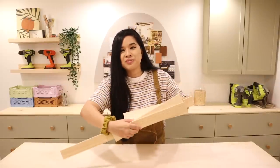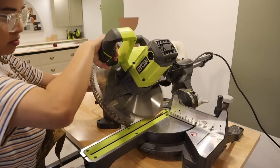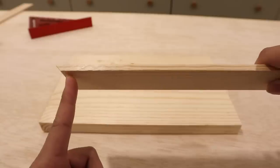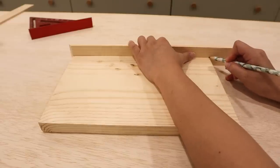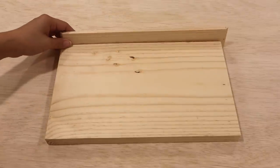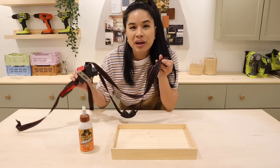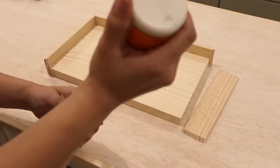I'm going to measure these out and make a little frame. We are essentially building a frame around the board to create a lip for the tray using leftover lattice trim, cutting it with my miter saw to give it a 45-degree angle on each end. Instead of doing exact measurements with my measuring tape, I'm taking the piece of wood and marking off where the edges are. Once lined up I make my mark and use my square to get a perfect straight edge. To attach it I'm going to use wood glue — I also have a strap clamp so that should hold it together and be strong enough.